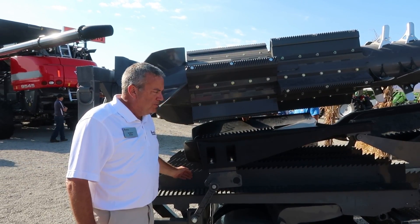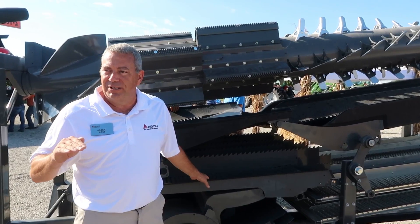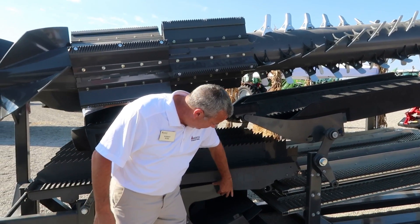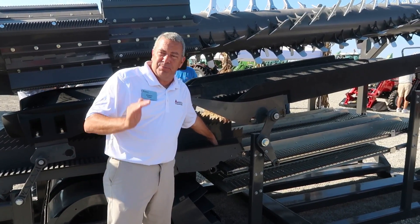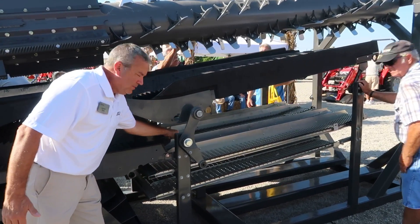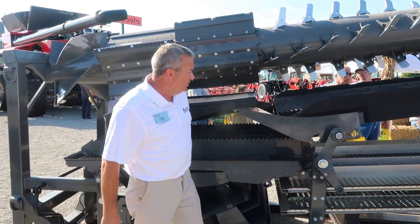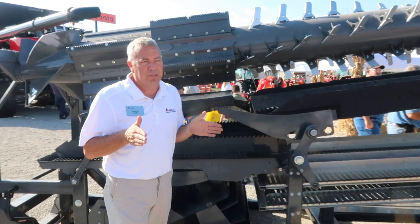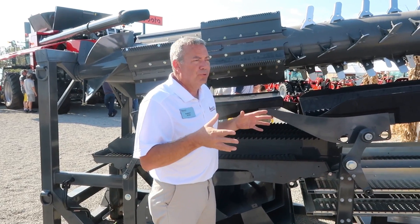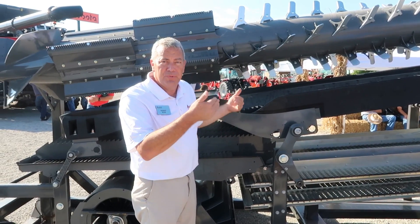We have dividers to hold material in place on the stratification pan, where we're shaking it and moving the heavy grain to the bottom and the light material to the top — that's the first part of separation. You have an air duct right here to get a blast of air as the material is coming off the stratification pan, another air duct coming in to get more air as it moves off, and then of course the air that lifts it up on the shoe itself. With axial combines, the direction the rotor turns can give you a potential overload on one side or the other, so we're controlling the flow of material with our pans to get it down most efficiently.